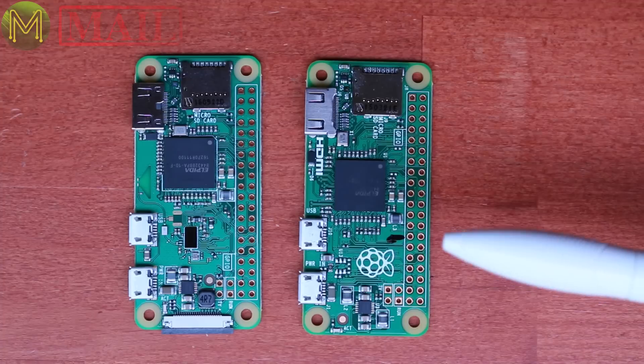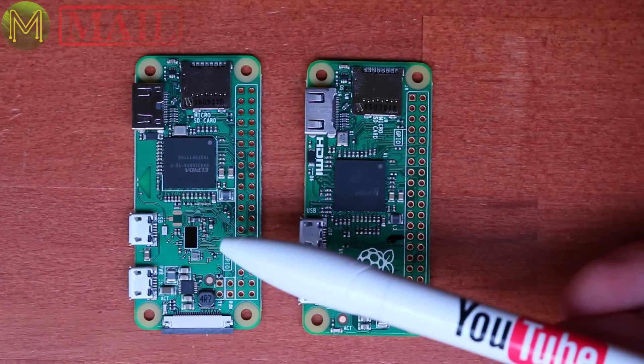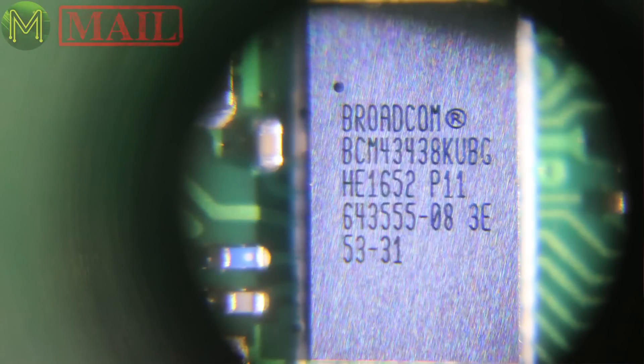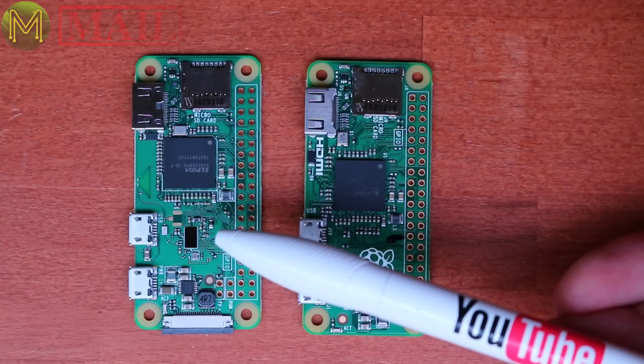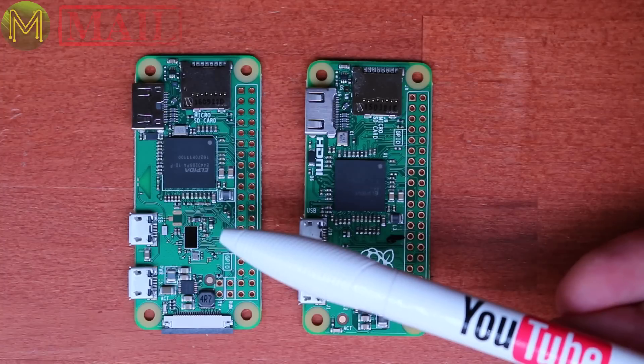The big major difference between the original PI Zero and the PI Zero W is the inclusion of this Wi-Fi chip. If we zoom up, you'll see it's the BCM43438 chip — the same one used on the PI 3. So this one supports Wi-Fi, Bluetooth, and also FM radio. The PI 3 didn't support FM radio as they ran out of routing room, so it'll be interesting to see if they routed it through on this board.